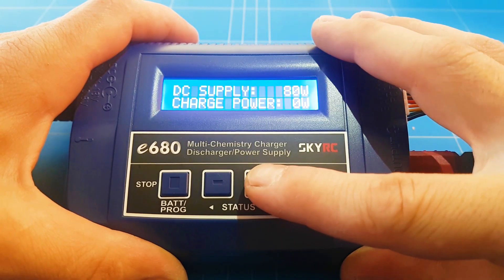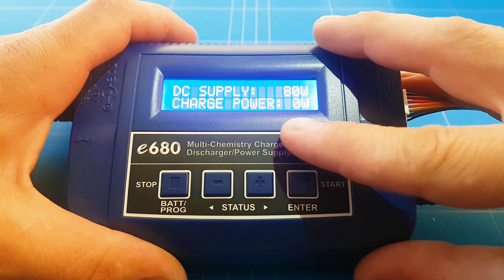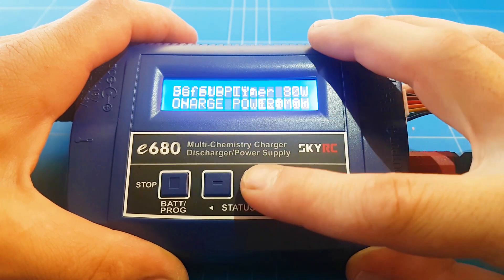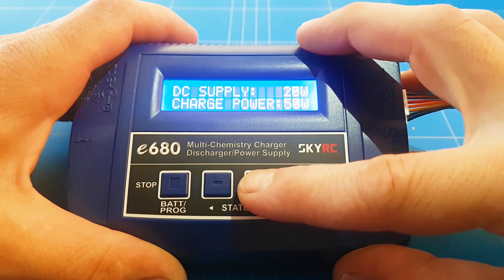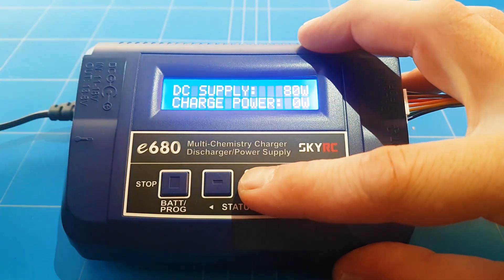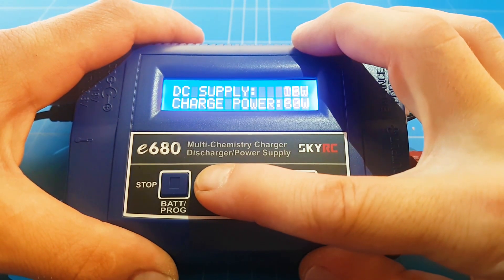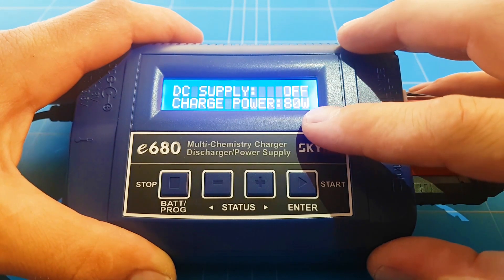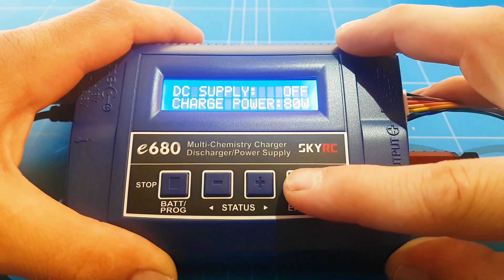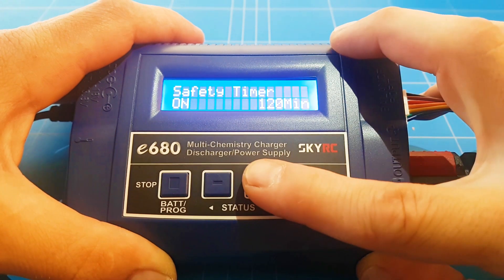Sorry for the airplane noise. DC power supply is at 80 watts charge power — let's change that up because we have no DC, we are running on AC. That's the nice thing about this — super easy to use at home. We set DC to off, and charging power to 80 watts, so we're using the full amount this LiPo charger can do. Click start — that's okay.